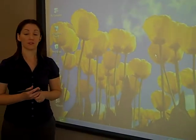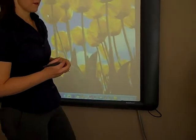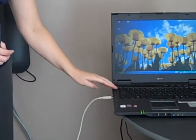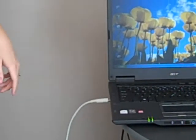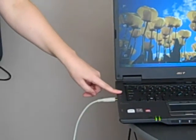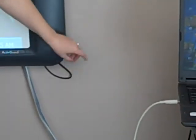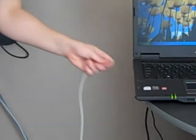What we're going to do now is a power cycle to get the board and the computer talking to each other again. The first thing we need to do is unplug the USB cord from the port — this assumes you've already tried plugging it into different ports in case it's just one port that's not working. The USB cord will either come directly from your board or from a wall plate on the wall, so we're going to unplug that.